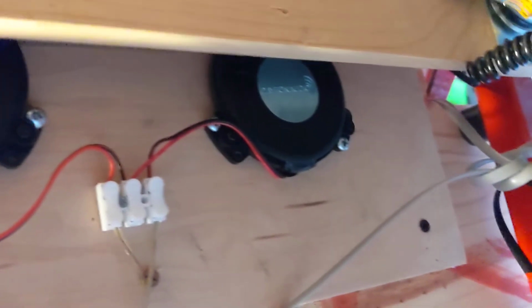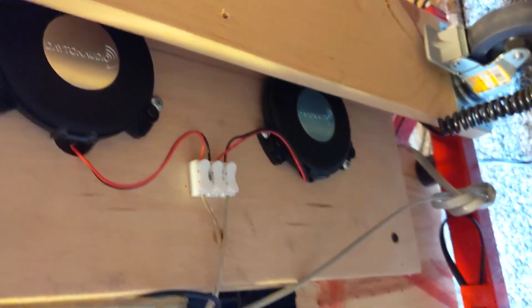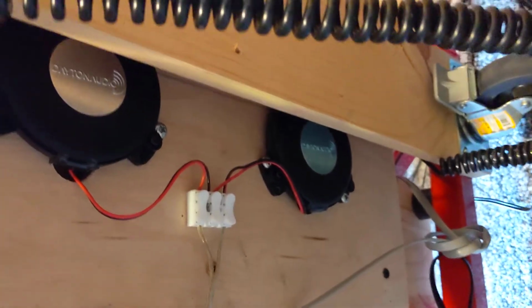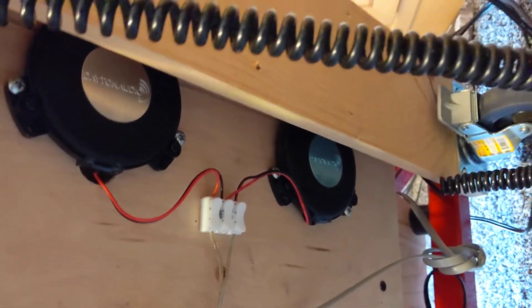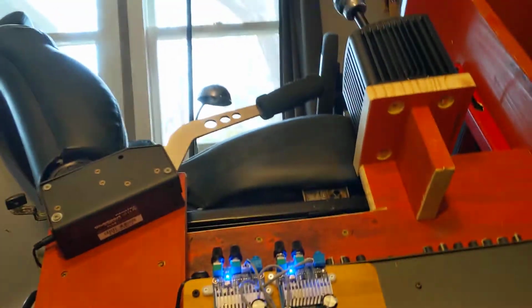how's that for lighting? Pretty good. These are Dayton TT25s, I think. I started off with one and then I added a second one because they're $18. So these are two 8 ohm units in series, so effectively a 16 ohm load on the amplifier. And I doubled up because I could get the vibration I wanted by turning the amp very high, but I felt like I was driving these too hard. In fact, I'm still driving these too hard. They might just melt one of these days.